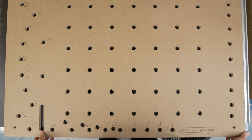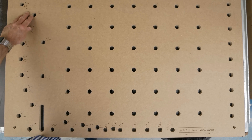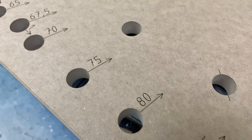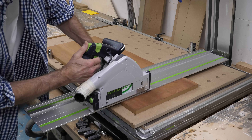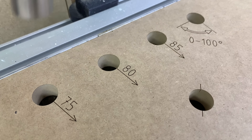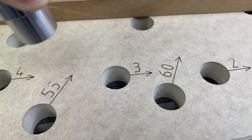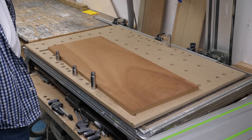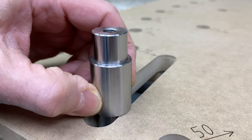Let's look at the pattern of holes at the top, as that's what sets the Vario Bench apart. You have a fairly standard grid of holes in the centre, but it's the ones around the edges that make it unique. Due to the laser-etched markings on the surface, with the taller Bench Hooks in the 90-degree holes you can make standard straight square cuts all day long. Move one of the hooks to the 75-degree mark and you can make a 75-degree cut. Change the base to plus three and you make a 78-degree cut — or 63 degrees, or 88 — or use the common presets at 22.5 or 67.5. And if you have an angle that really doesn't fit, you can use the slots to achieve virtually any angle.